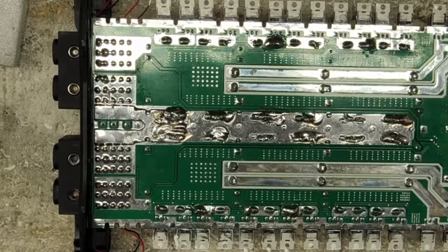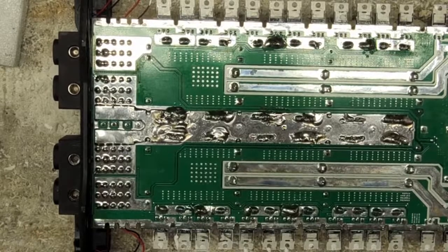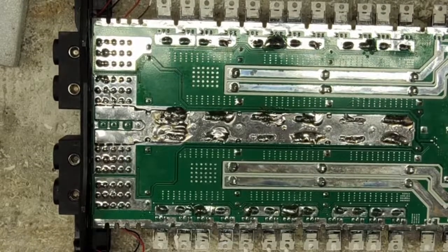Fingernails on a chalkboard, guys. So if you're sensitive to that kind of noise, please feel free to turn the volume down. It's just going to take a second to get rid of this solder mask here. Really quick process, so I'll be quick with this. What I do is I use a scalpel to expose the copper. And I do it relatively quick, because in a second I'm going to grab some flux and put some flux on this copper to keep it from oxidizing.